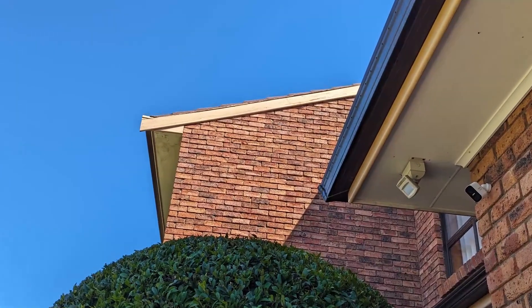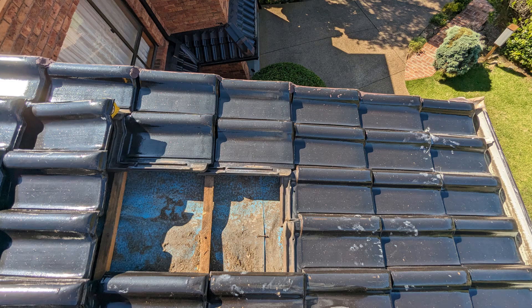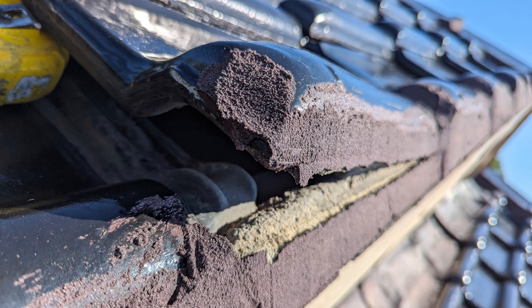We're going to look at a typical barge here. This is a Swiss tile roof, and we're looking at the barge — it's been pointed, and it's just been pointed over the fibro. If you take a few tiles out just to see where the leak is coming from, and you get closer to the edge, you'll see that as we lift the tiles up, that's where the water is getting in through the crack on the bedding. There's a fibro strip just underneath that, and if you look underneath you can see the fibro strip with the bedding.